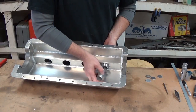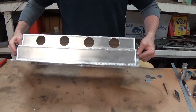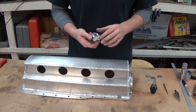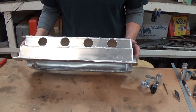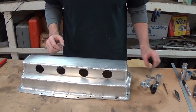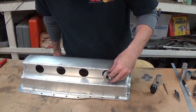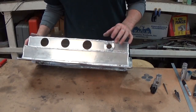Sitting a half inch off the bottom means we don't suck up dirt and whatever else collects down there, and gives it some room to breathe. That means we'll basically maintain a running level of oil on the very bottom of the pan, but that's fine — we're not going for every last bit. This engine doesn't have piston squirters or any other fancy lube setup, so we still want some oil whipping around to get on the cylinder liners and the bottom of the pistons to cool them down. Once all the assemblies are done we'll weld the bungs in all the way around and the pan will be finished.